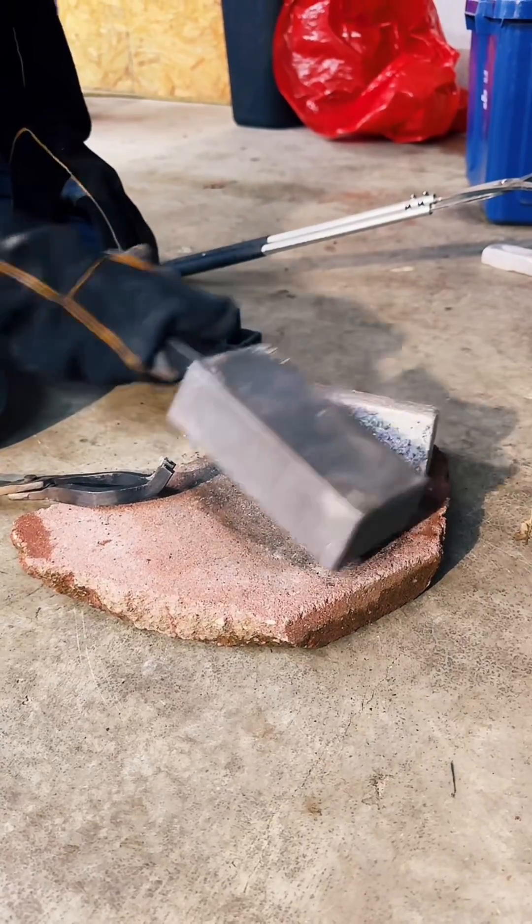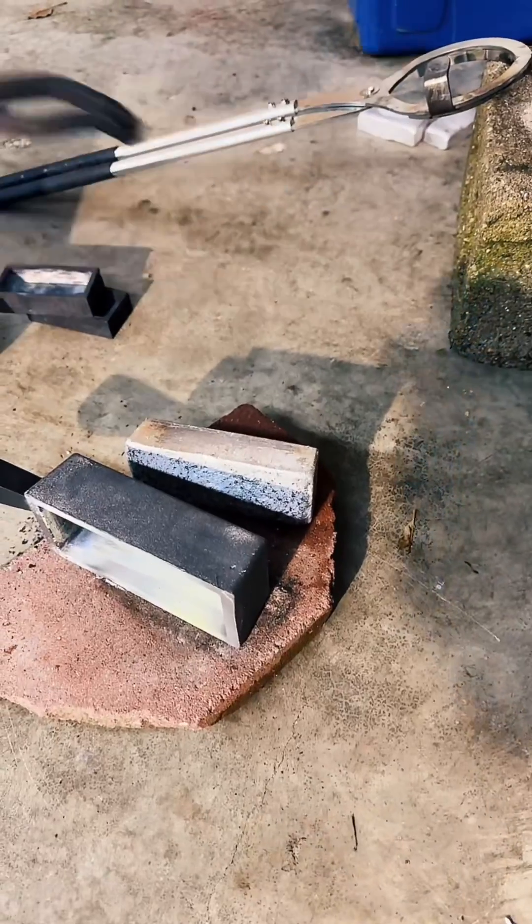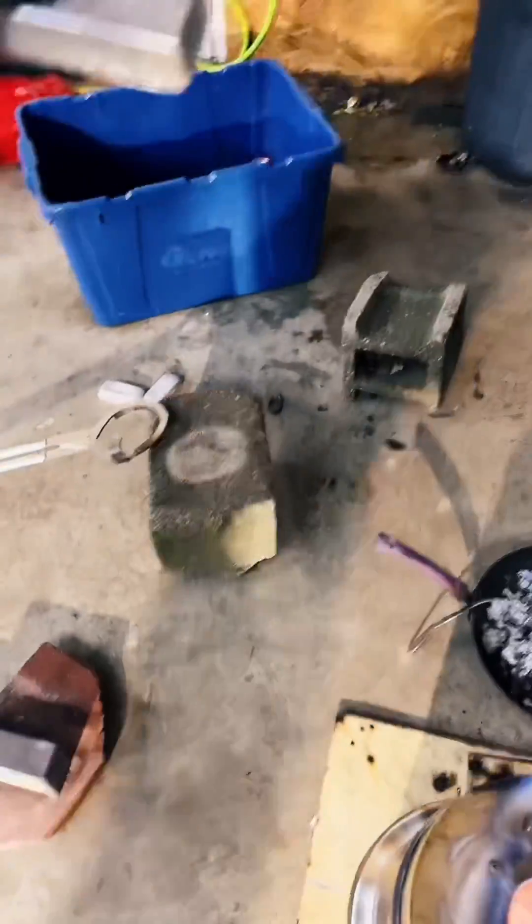On this pour, we made a bar by melting together copper and aluminum. We had to get the crucible to at least 1,984 degrees Fahrenheit to accomplish this. After extracting the ingot from the mold, it's time to take it over and quench it in ice.